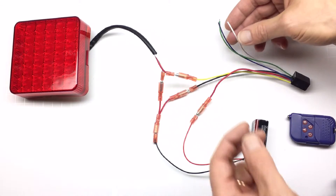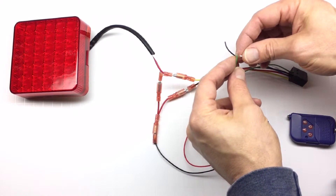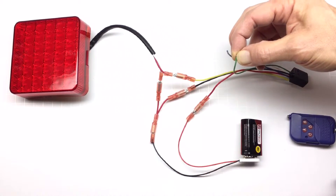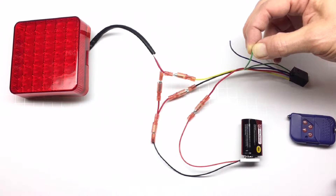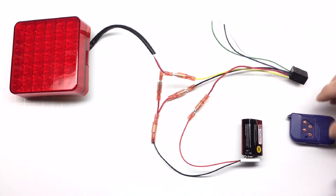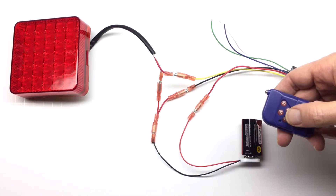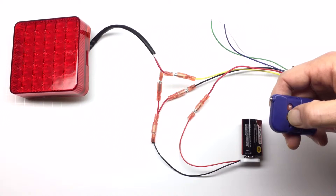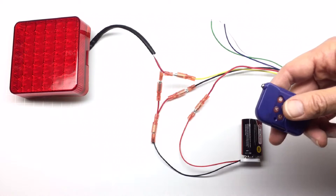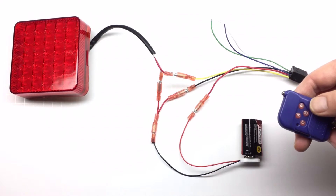So what I'm going to do, I'm going to take two control wires — configuration wires, white and green — and short them, and supply the power. After five seconds, the light will turn on for just one second, telling us it's in pairing mode. Now I can push the remote button, for example A, to pair button A. The light comes on for one second, so it stores the proper code for this remote button A, and it's now paired with button A.